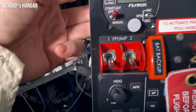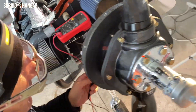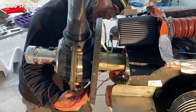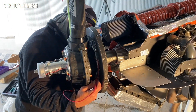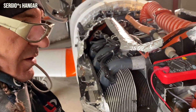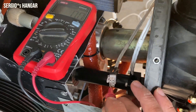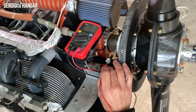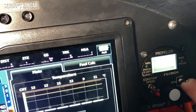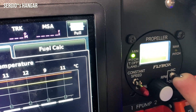This outer wire should go to the outer position. The red one goes to the center. We have agreed on that. Now checking which one is the plus — it's the one close to here. Increase RPM: increase RPM. Max pitch light off. Min pitch light on.